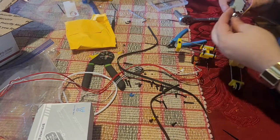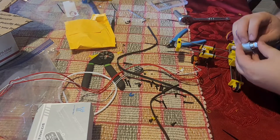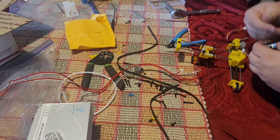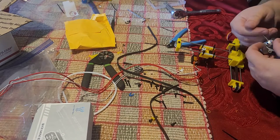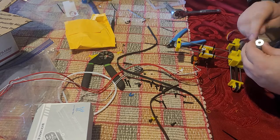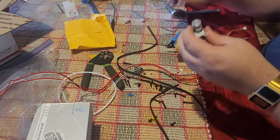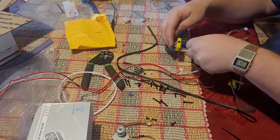Let's put the pulley on right now, but you do not want to mount the motor until after the belt has been installed in that section, because it's difficult to get the belt through. I'm using the wrong Allen key. An M2, not an M1.5. There we go. All right, so we're going to take the belt, and we're going to feed it